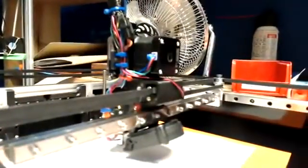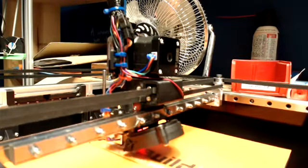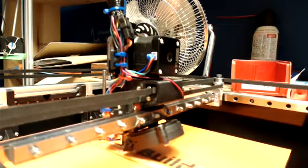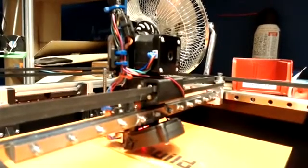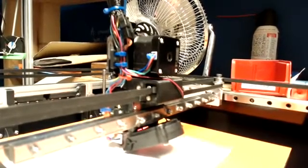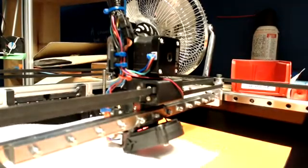I have double-tap enabled so it's going to tap twice. It's tapping more than once because I have a sheet of paper on there. Once it finishes, I'm sitting at Z 8.87. I'm going to move down to around Z8-9, put a sheet of paper under the nozzle, and jog down using the panel view or the interface until the piece of paper grabs. There we go — my paper is grabbing.